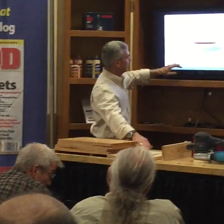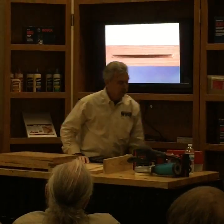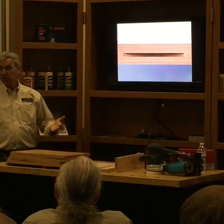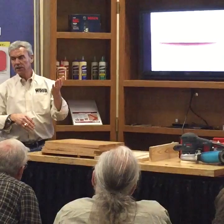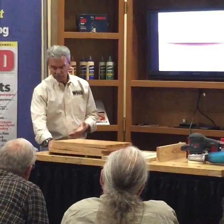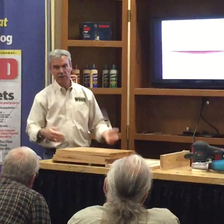This piece of cypress is a little bit thicker, so my line here is a little bit fatter on the top than it is on the bottom, which just means when you're using a biscuit joiner, if that's what you feel you need to do, mark your wood so that you're always indexing against the same face, okay? So if mine indexes against a flat surface, I'm going to put my good side down on all of those so that I'm sure that when I get done with it, I've got them even.